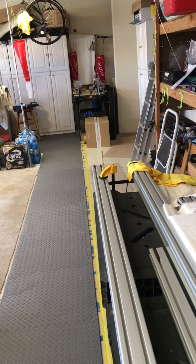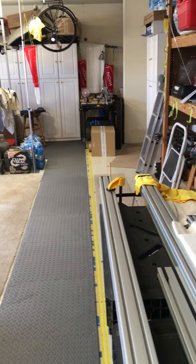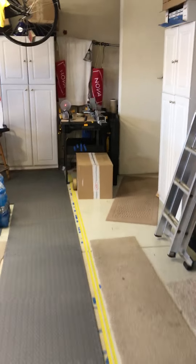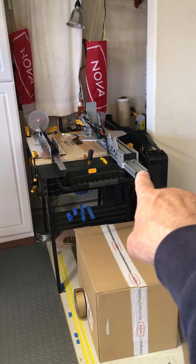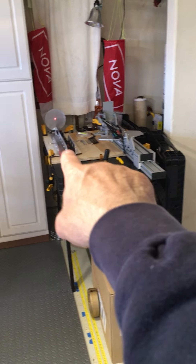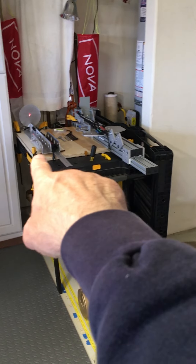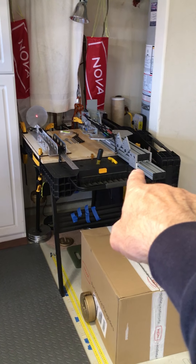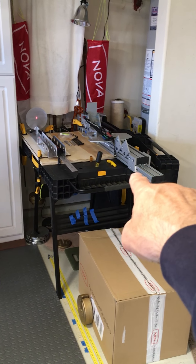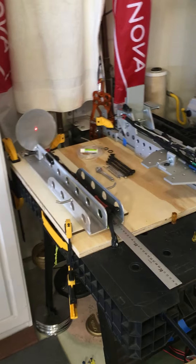So let's go down to the other end. There's a laser target, or the beam — laser beam on the laser target. I'll show my new laser target assembly that I've installed. Over here is my former laser target assembly, and here's my new one. It has a lot less back pressure than this one, because there's a lot more weight to it obviously. But this has linear — see those little white pads? They're underneath between the two rails and on the sides as well. There's a bunch of them, so it runs butter smooth, but it just had a little more back pressure.